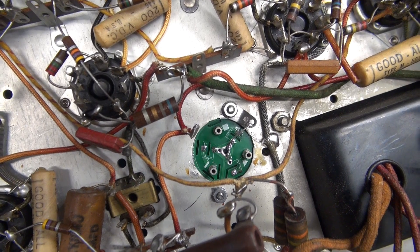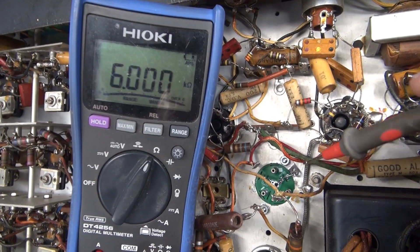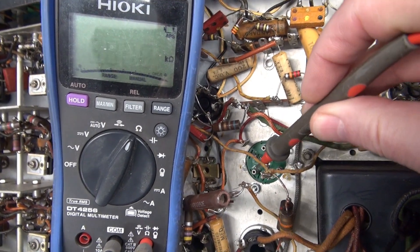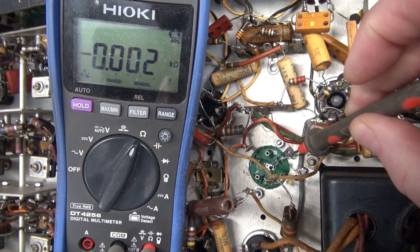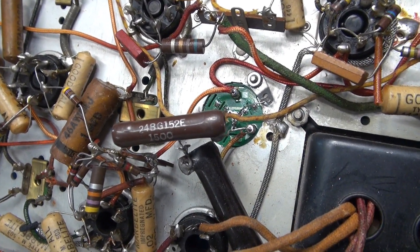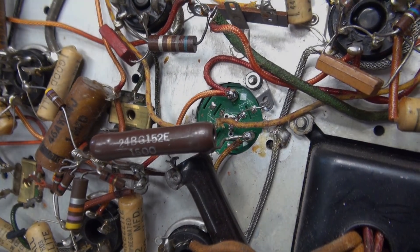Now it's time to swing the wires on the turrets and get going. As a precaution before you wire, you should check all three positive sides of those caps and make sure none of them shorted to ground in the process. All wired up and ready to go — this completes the installation of the W8AOR economical filter cap.